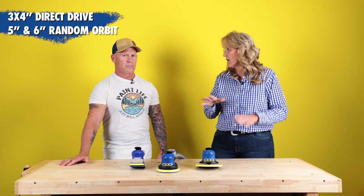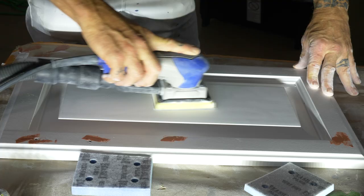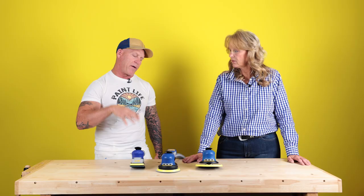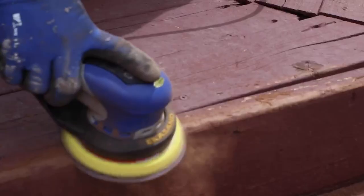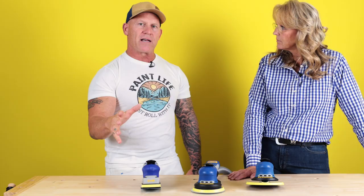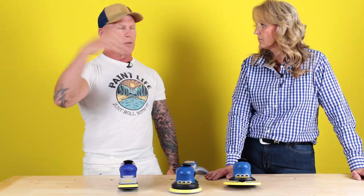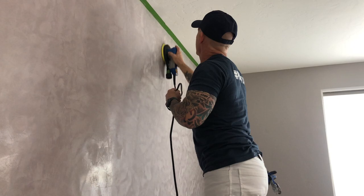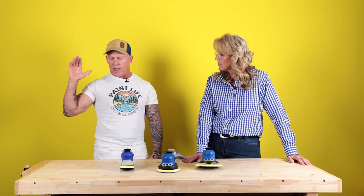To summarize my personal applications: I use my 3x4 for cabinet refinishing and repainting interior trim — hooked up to a vacuum so I'm not creating dust. I use my 5-inch when refinishing decks and exterior work — it's a little bigger and faster for decks than the 3x4. I use my 6-inch for polishing venetian plaster on large walls. All three sanders hook up to the UNIDA sanding system with vacuum capability.